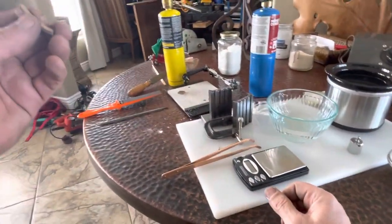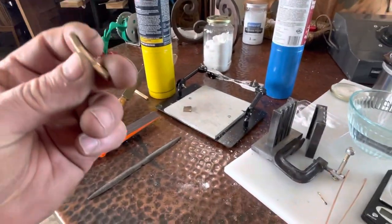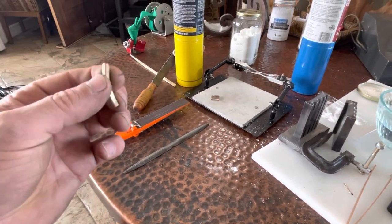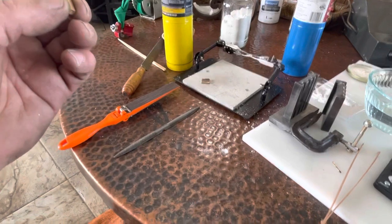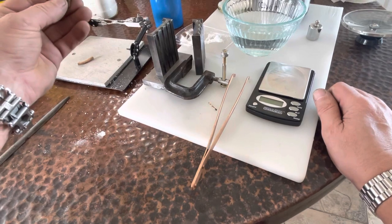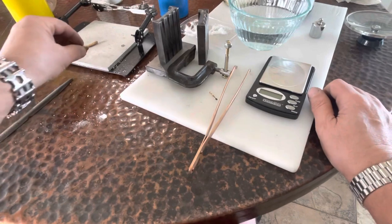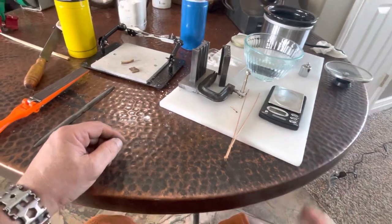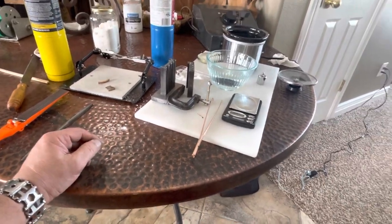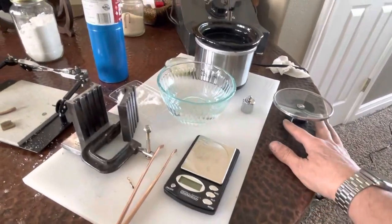Like I said, you get it to whatever thickness you want in the square, and then you pull it through a round draw plate. You got round wire, you got square wire. You can compress this flat and have a rectangular wire. Everything's possible with the rolling mill. Yeah, I was gonna definitely anneal this again, but hey, here's my two little scraps of gold. And, I could mill those out to make some useful jewelry. Useful. Because everybody needs jewelry.